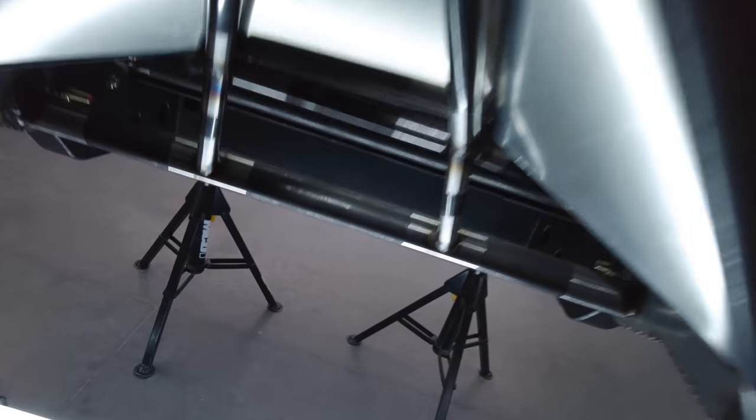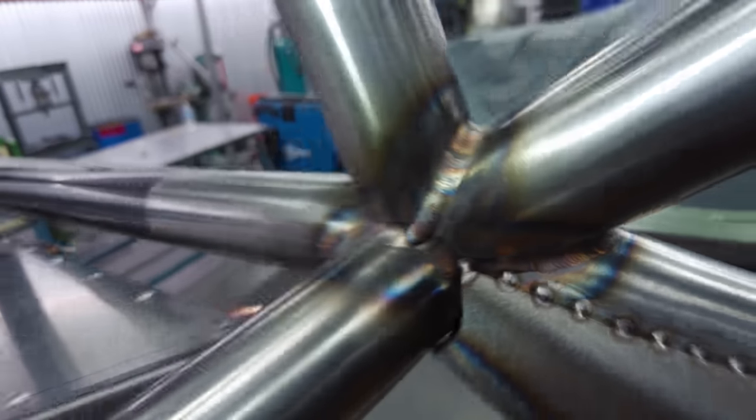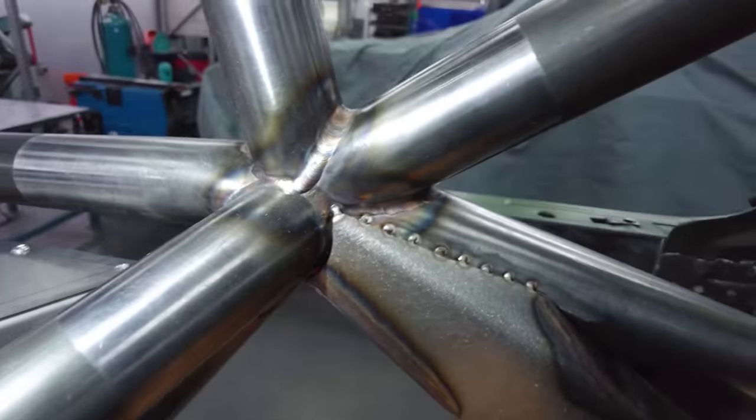Everything has been gone through as far as the welding. I had to cut some sheet metal out to get 360-degree access. There's root pass stuff under there for the one-inch tubes — something we haven't talked about yet. You can see all the junctions. There's really good symmetry in here — all the tube sections are welded first and ready to get final passed.